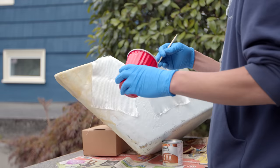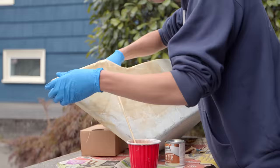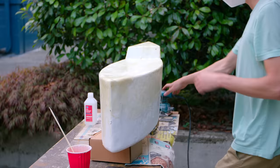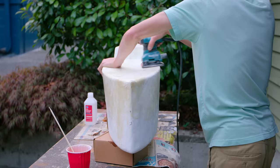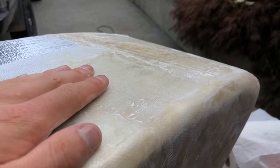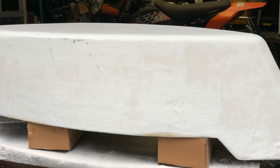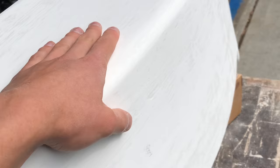After that, it was more layers of fiberglass, and I used Bondo resin, which was a real mistake. It's designed for small layup jobs like fixing cracks in your shower, so the cure time was way too fast. Because of that, I had to do small sections at a time, and it ended up not being very smooth. That led to the need for more spackle, more sanding, and more painting. But eventually, after days of work, I got it pretty smooth and painted it bright yellow.